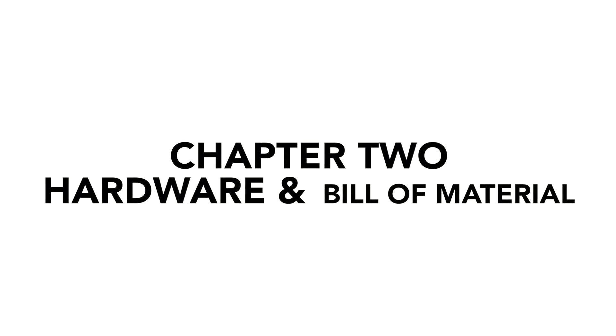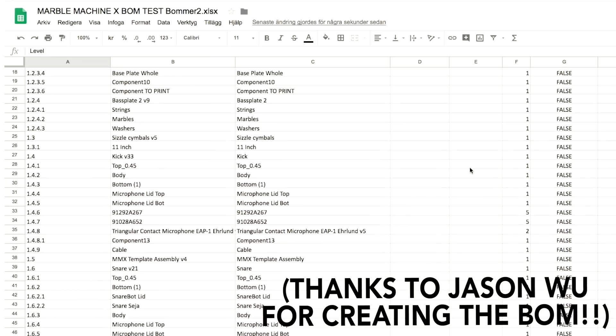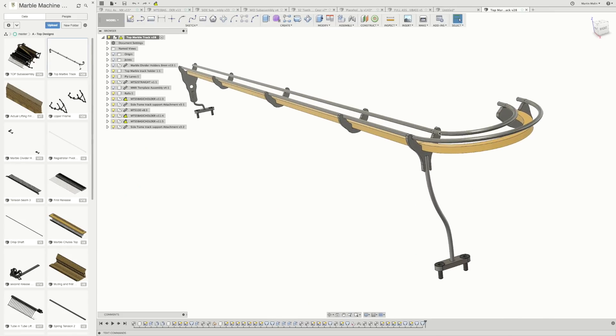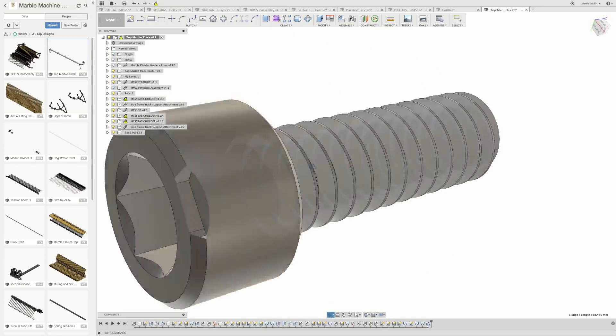The second chapter of this story is the bill of materials, often abbreviated BOM — a list of parts for an engineering project. One of the big benefits of designing in CAD is that you can include all your hardware: all your screws and washers, and have the program compile a bill of materials for you. In Fusion 360 you can import 3D modeled screws, but these threads have a very complex geometry with a lot of faces and that bogs down Fusion's performance.